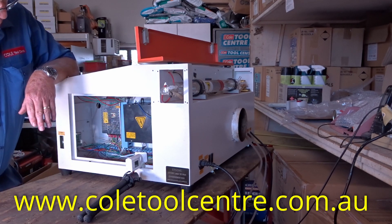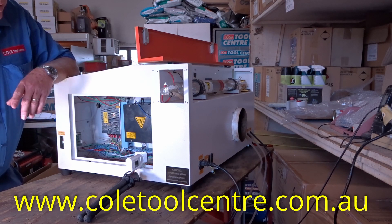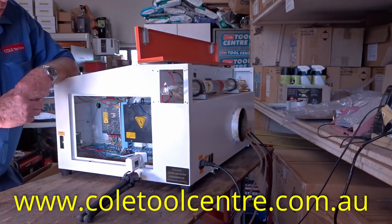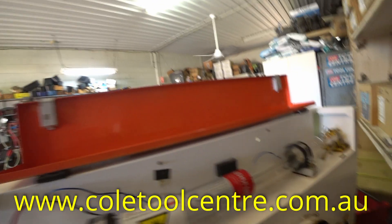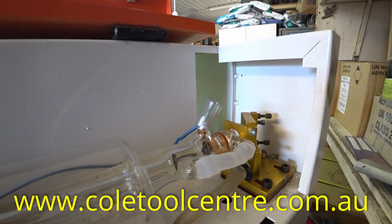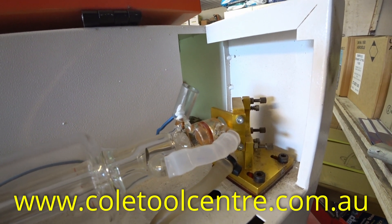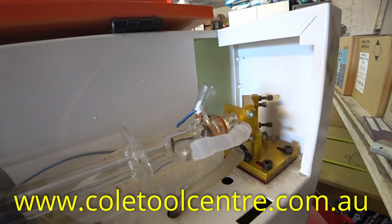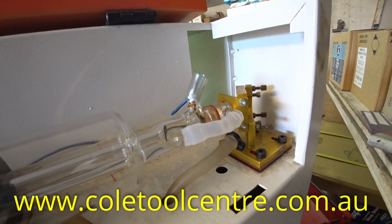Now, if our LED is lighting up and the tube isn't firing, we either have something wrong with the tube or something wrong with the power supply. If our tube has lost power and we have had firing all the way through, then we test the output and see if it's within tolerance. If it is, that probably means our power supply is okay and there's a good chance the tube is losing power and needs replacing.